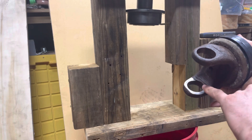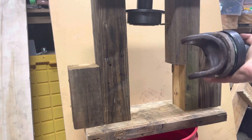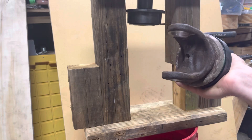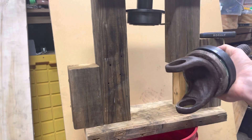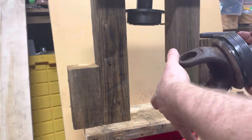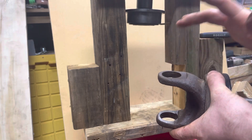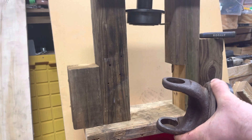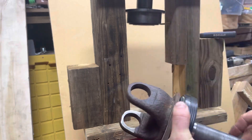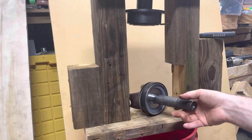Next, something I've had to do on the other yokes: I took an angle grinder and just took off the rust and a little bit of the buildup so I can get my c-clips that retain the cups on the u-joint in there. I've got another video showing how to pull these rusted seized u-joints apart without destroying the yoke. Don't use one of those big c-clamp style presses to push these apart if they're rusted and seized — all that's going to do is crush your yoke. Those big c-clamp presses have more than enough force with an impact gun to smash that relatively thin metal. I was able to bend it back and use it, but I'll probably have to replace it at some point.